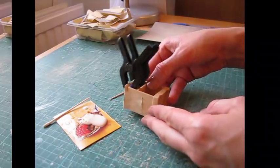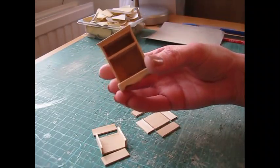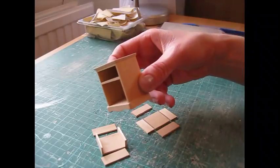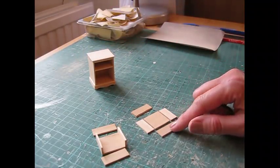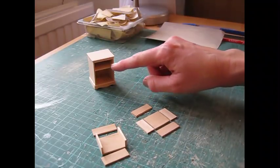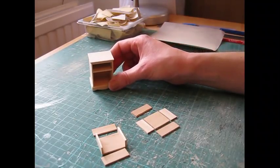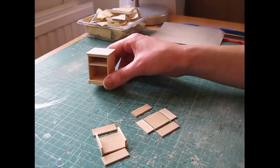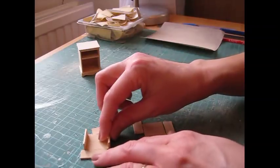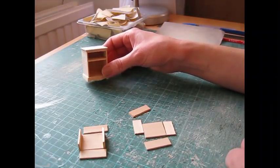Once dry, we've just got to make the drawer. After allowing enough time for the glue to dry, remove the masking tape and sand the piece all over using the finer grade sandpaper to prepare it for varnish or paint. Cut the pieces for the drawers after construction of the cabinet, as slight misplacement of the central shelf will affect the size of the drawer opening. When measuring the opening, take off half a millimetre from each measurement so the drawer fits better and slides in and out nicely.